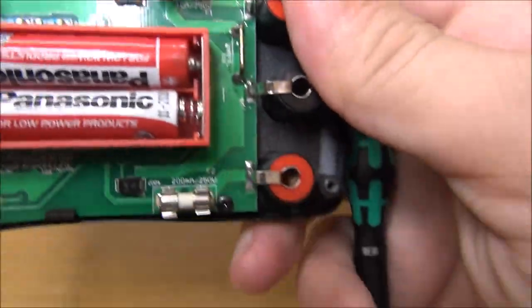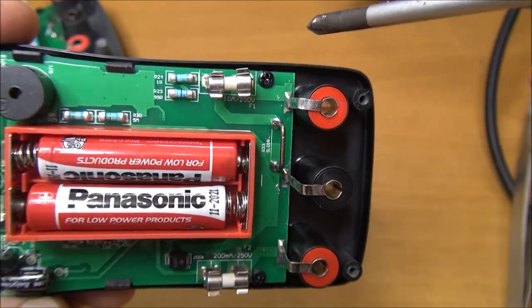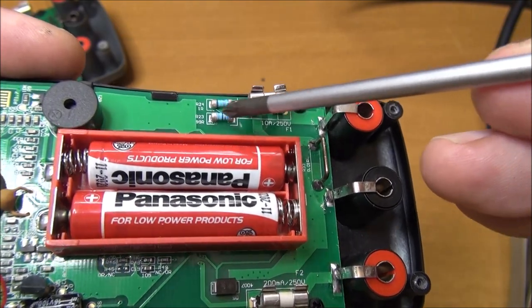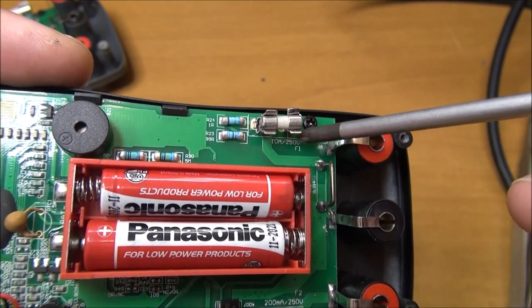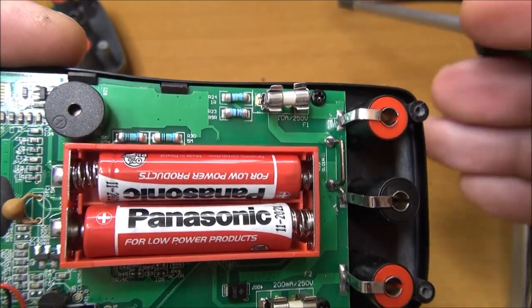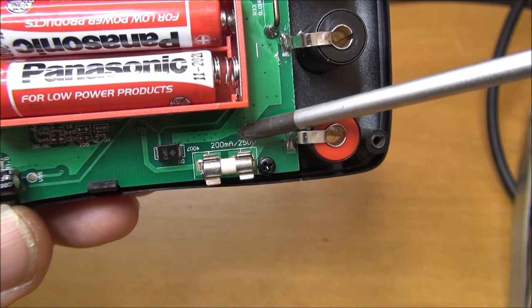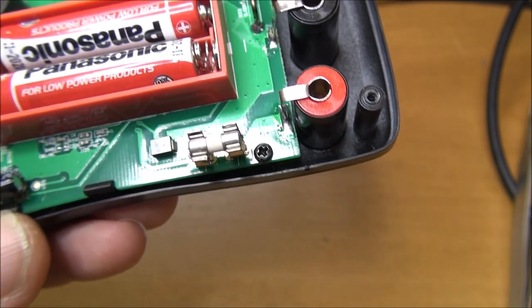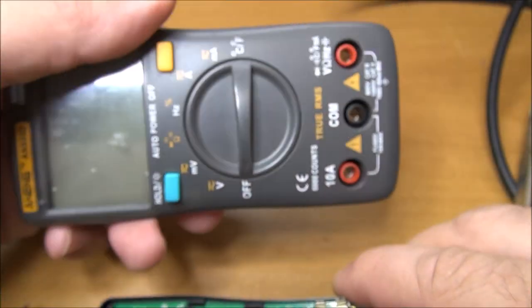On the 8008 model, it's not easy to replace the fuse because the body of the new fuse will cross the parts on the PCB, and you need to reconnect the other side of the old fuse to the new one with a wire. Ethically, making those modifications makes it really unsafe. In this way, the hole on the PCB is too eccentric and will disturb the fuse holder's placement. And the track pad is too thin, unlikely able to hold a fuse holder. This one seems nice with the new fuse, more professional.